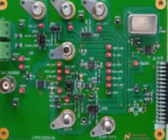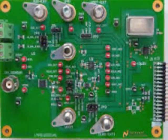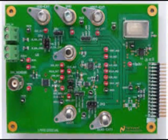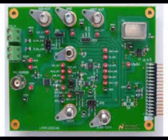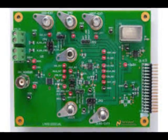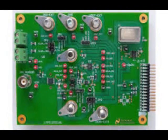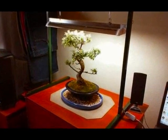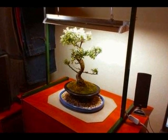Addition of a pH sensor module along with the MSP430 G2553 is possible using a SPI interfacing protocol. The pH values could be used as a reference while circulating the nutrient solution in the setup. The beauty of this technique is that it could also be used for cultivation of any kind of crop, perennial, annual or seasonal, and also in the art of bonsai along with other ornamental plant systems.